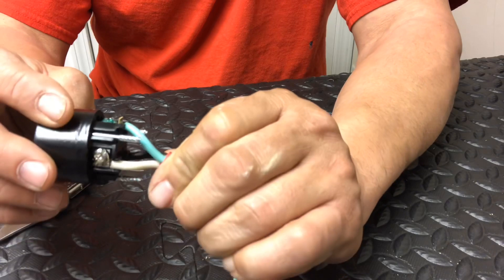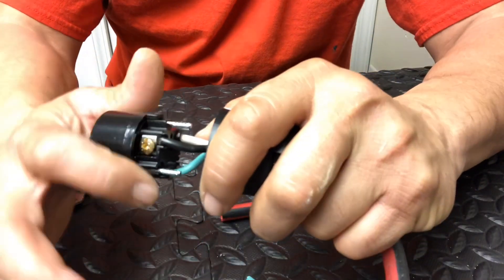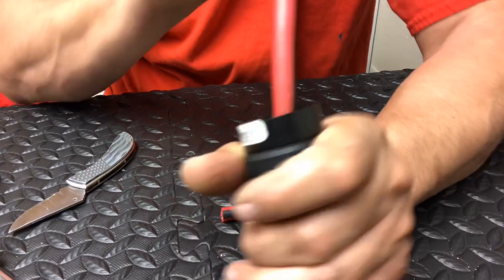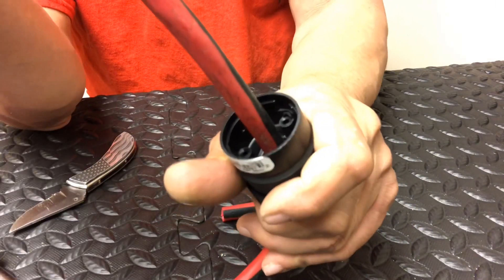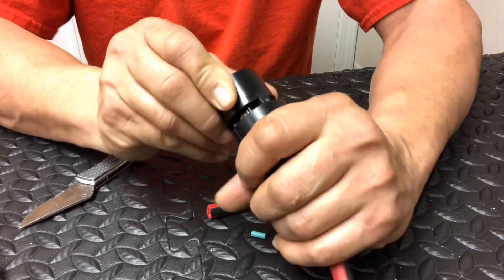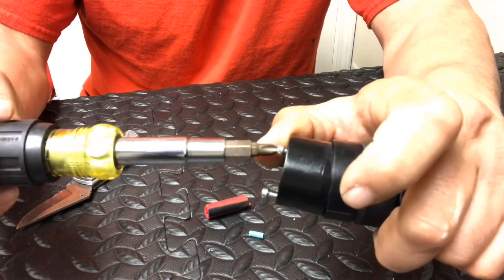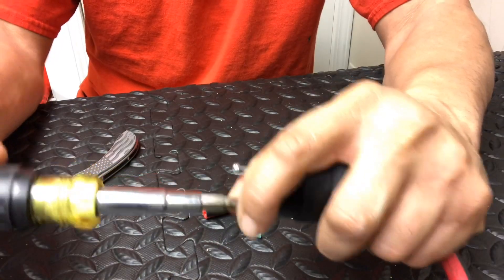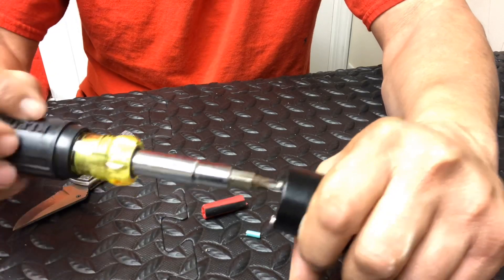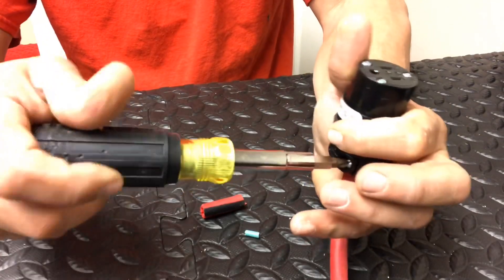Green, black, white. Green to green, black to gold, white to silver. To know which way it goes in — this is far apart, these two are close together, these two are far apart. If you look inside you'll see the same thing: far apart, far apart, close together. Here's my close together — twist it so it'll work. Now when you screw in, they go pretty fast. Make sure they slide in, all three are going to go: one, two, three. Tighten this down — don't go too tight, you just need to get it snug.